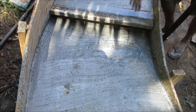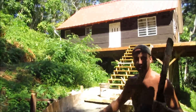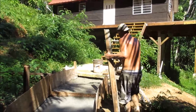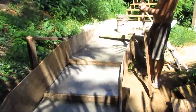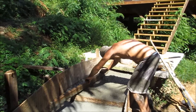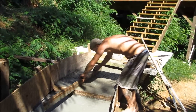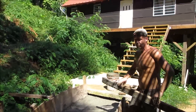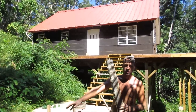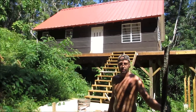You can see the finishing work on these steps. Once it sets you can put an edger on, then use a broom to lightly put a non-slip surface on top of the concrete. First you use a stick or a two-by-four to level it out, and once you have it leveled and all the rocks settled, then use a float trowel on top, and then do the same thing with the broom once it sets a little bit. This is going to be probably here longer than I'm alive.